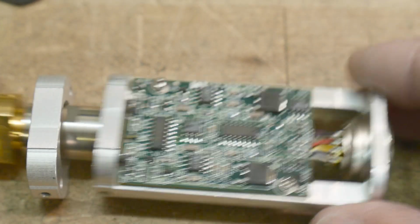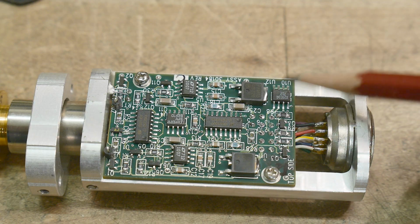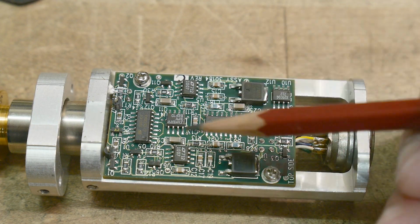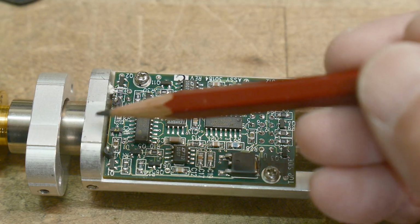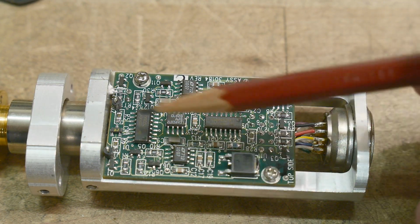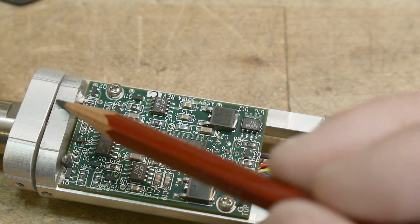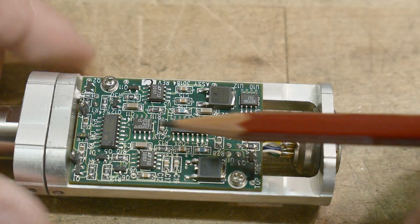Let's zoom down here. I'll put this under a different microscope, but basically there is a voltage regulator. This is the E² prom that holds all the calibration data. There's actually 2 voltage regulators, plus and minus, and there's a bunch of circuitry in here. And long story short, this is a chopper stabilized amplifier, okay? There's a chopper amplifier right up in the sensor, as close as you can to the diodes themselves, where you want to do the detection. And then there's a little blob of white right there. That's some RTV. There's a thermistor there, so it's measuring the case temperature of the sensor, because you need to know that. Op amp, chopper. Anyway, we'll go through all of that.